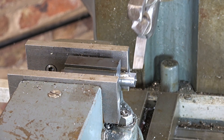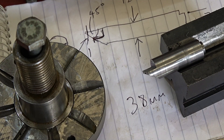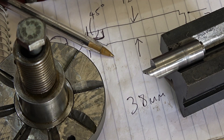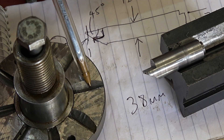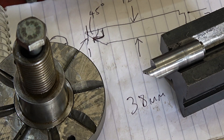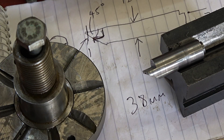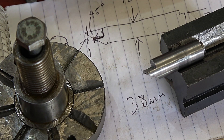This is where I could do with a table stop really. Well, it's the usual fluid design — make it up as you go along. This is pretty much what you see there, but instead of that being 45 degrees I increased the angle a little bit. And then I don't have to worry about this curved back edge here because that angle there clears it. So I'm just going to file a slight radius on there so that it's smoother across the edge, and then really it's just hardening and tempering.